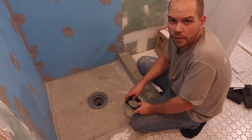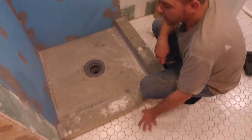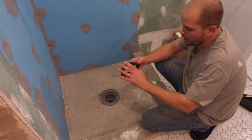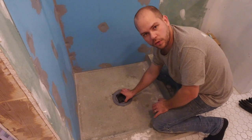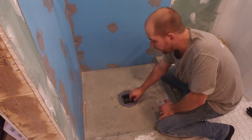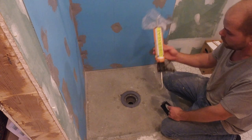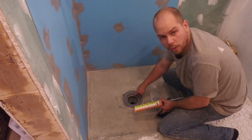Hey everyone. So we have our curbs installed now. We actually got our floor tile in. Now I'm getting ready to install the drain grate. This drain actually has some movement in it, so you can center it to your mat, which is nice, so that you have a bit of play in regards to where your pattern falls with your tile. How this works is you take your Uber seal and you put four dots on these yellow markings